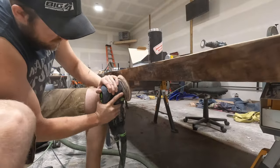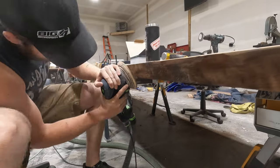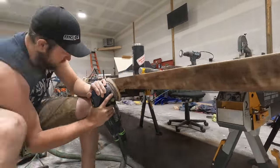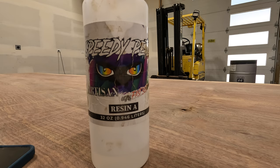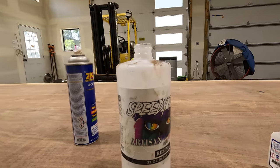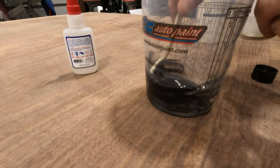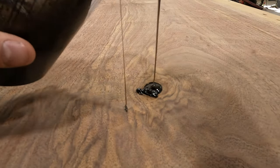I typically like to use a dull chisel to get most of the bark off, and then I'll come back with the sander and do a light sand on it, trying not to remove the natural shape of the edge. For all the smaller cracks and voids, I like to use DIY Epoxy — that's called Speedy Peedy. Sets in like 15 minutes and sandable not too long after that.